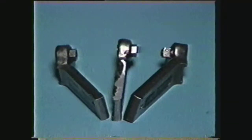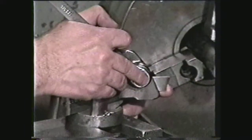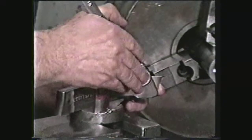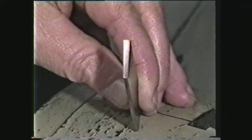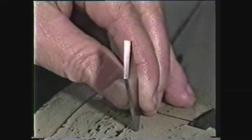The tool holders are available in straight or offset design. The advantages of this type of cut off tool are: the blades can be replaced, the blades can be adjusted in the holder to accommodate varying diameters of work, and the blades can also be sharpened repeatedly before they must be discarded. Blades are manufactured with beveled sides to provide side clearance, so grinding is necessary only on the end of the tool.